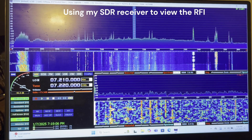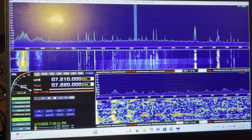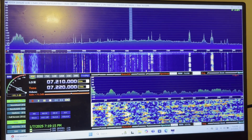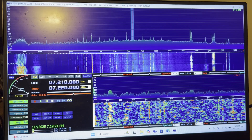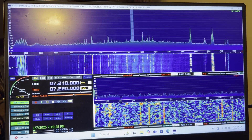That's 160 degrees, there's 40 degrees, and then here's 300 degrees. So at 300 degrees you can see the noise floor dropped considerably. It goes back up at 40 degrees and 160 degrees. So it looks like that signal is coming from right between the 40-degree pointed pennant and the 160-degree pointed pennant.